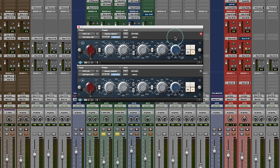Now, why is this particularly well suited for guitars? One of the reasons is that guitars essentially have most of their cut or most of their tone fit within a range that's very well represented in this EQ. So what you have is selected positions here, 220, 270, 330, all the way up through the spectrum to 1.2K. And then on the high mid band, you pick up from there at 1.5, and then work through frequencies up to 8K. When you're going through, you probably won't end up a whole lot higher than 2K, maybe 3K, because you start to get into a harshness.